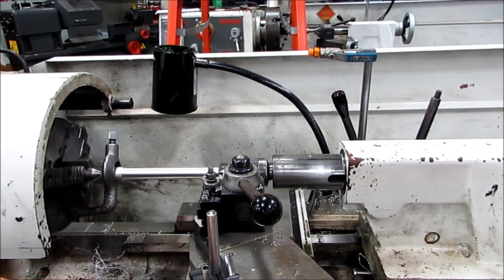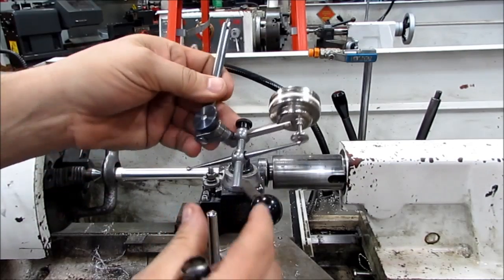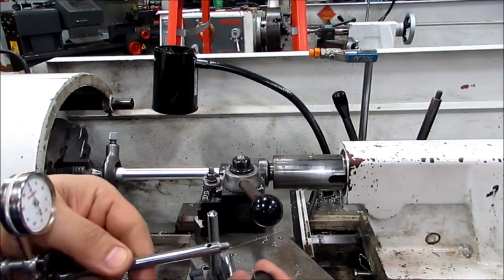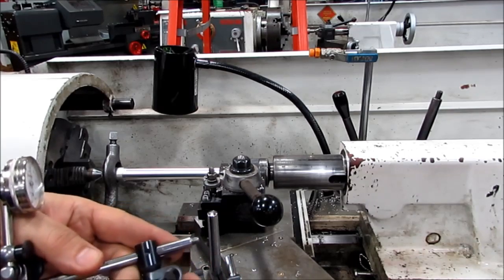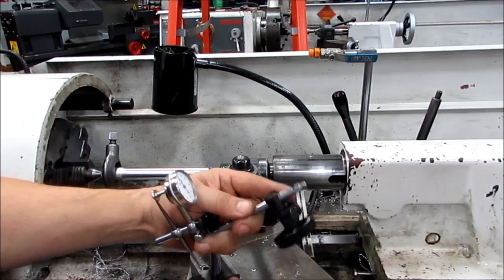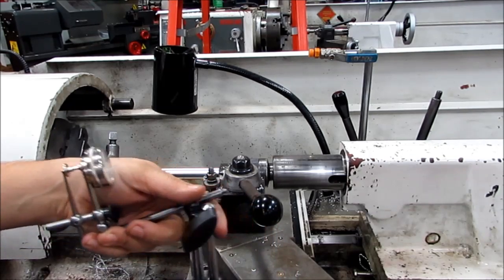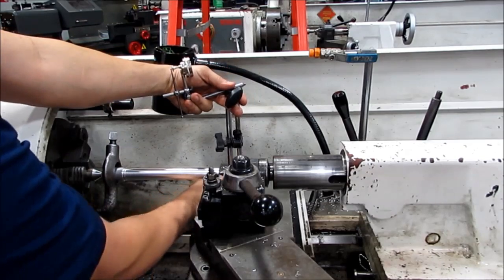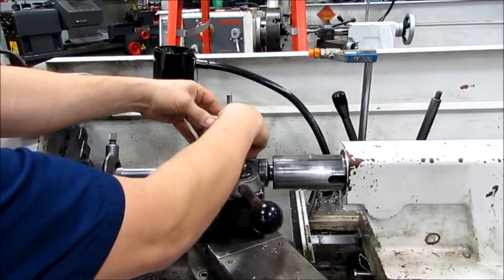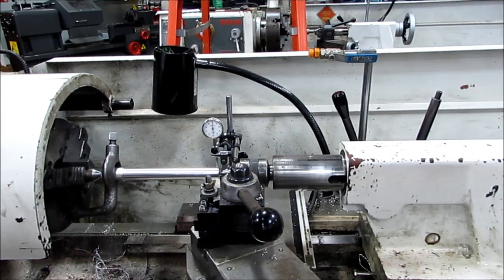The reason I don't like the micrometer is because when I use the dial test indicator it does the work for me. If I go from zero to a positive ten, I simply retract it back to the midpoint of a positive five and I'm good to go. The other style of indicator you might have is a button-back indicator. Some of our students have the 196 test kit that has the reversing indicator with a button back, the knuckle, and the arm. The arm simply goes into the same spot that your normal indicator base would go.